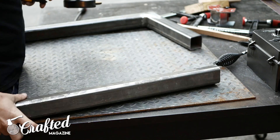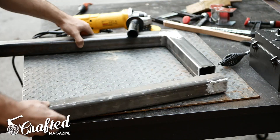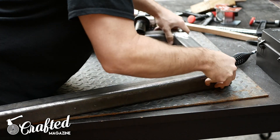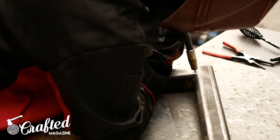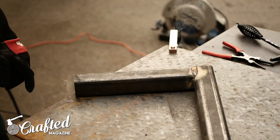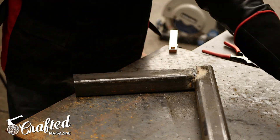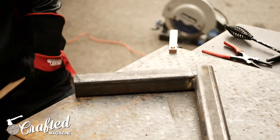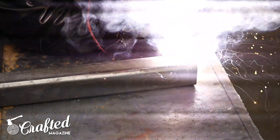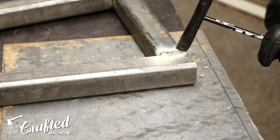On the first set of legs, I had a little trouble with my welds burning through and couldn't really figure it out. What I didn't realize was that the center connecting piece was actually 10 gauge steel — about an eighth of an inch thick — rather than the quarter inch thickness of the long pieces. I somehow didn't notice that when picking through my scrap pieces. They had the same outer diameter, so I can see how I got confused. I turned the amperage down, finished up the first leg, and then recut the center support piece using quarter inch steel for the second leg.